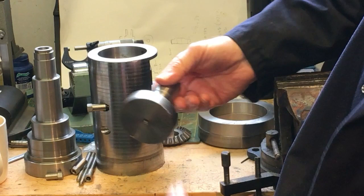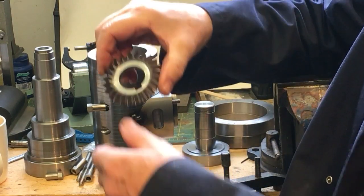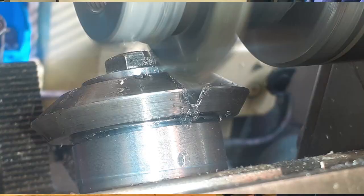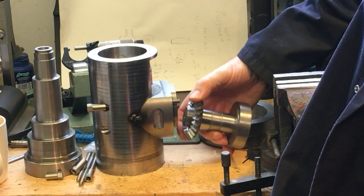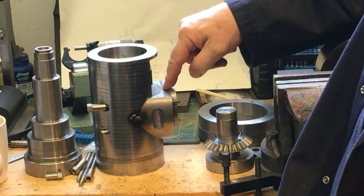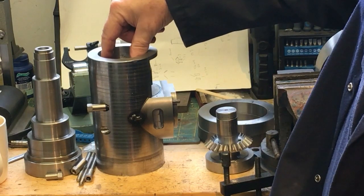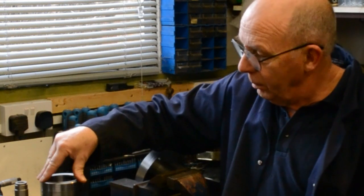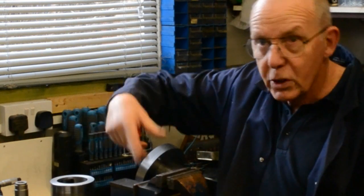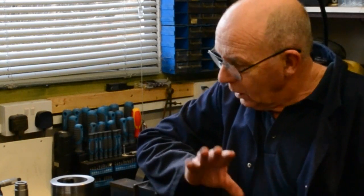There's the horizontal spindle that will be milled to take the drive dogs. That's one of the first of the gears I've got to cut — the bevel gear that will go on the horizontal spindle, sitting approximately there. It will mesh with another bevel gear, an 18 tooth, that will sit here. That will go up through a bearing block to an 18 tooth spur gear, which will then drive a 26 tooth spur gear, and because of the change around in rotation it will give me the correct rotation for the cutters on the vertical spindle from the horizontal.